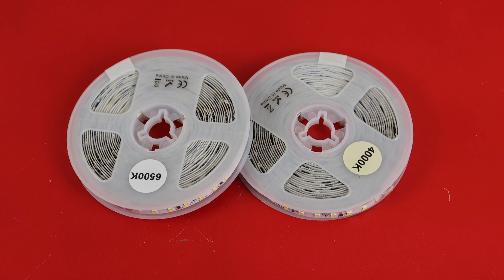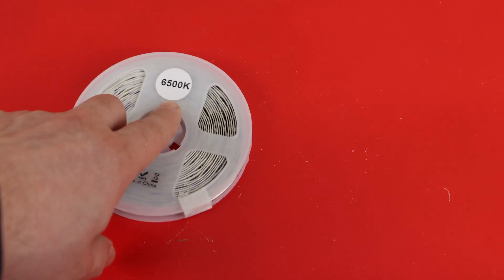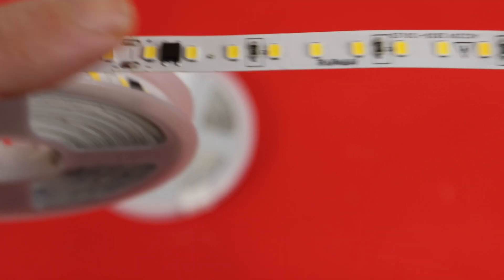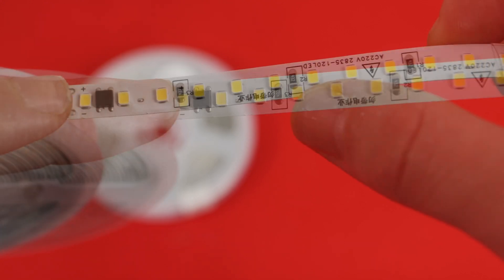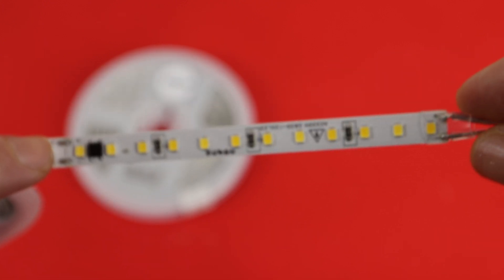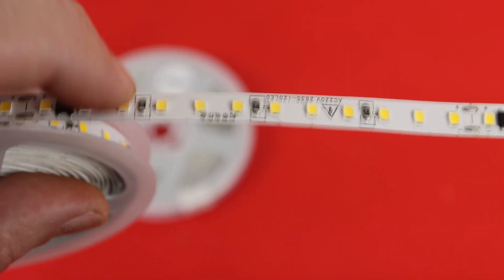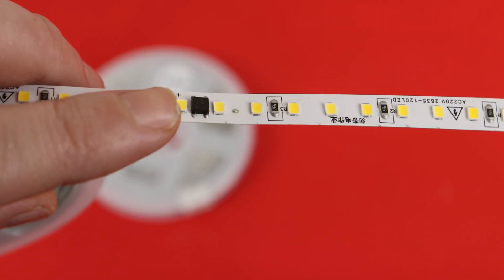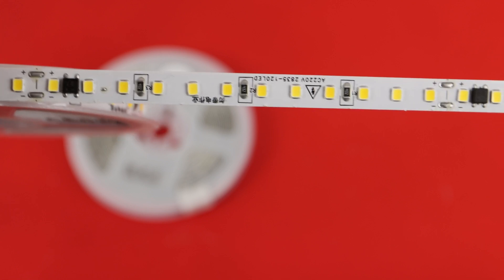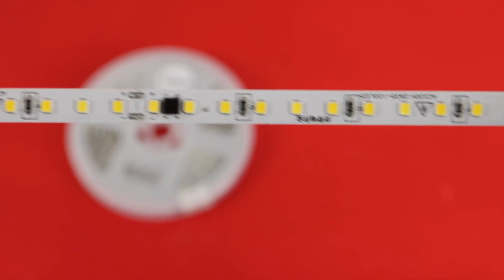I bought a few of them — this one is 4000 Kelvin, another is 6500 Kelvin, but they work more or less similarly. The circuitry is quite simple: they only have one voltage rectifier and some resistors, so you can actually cut them from these points and use them in your projects. Of course, you should be cautious because mains voltage directly passes through these LED strips and you shouldn't touch them if you don't want to get a nasty zap. It may still be okay to use them in locations where you cannot touch them, for example on ceilings or in enclosed surfaces.